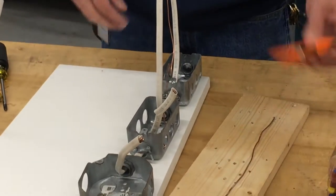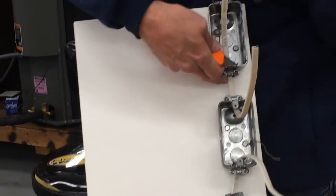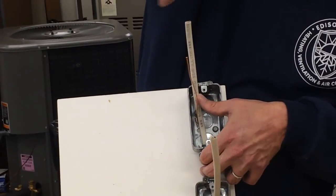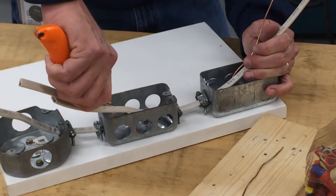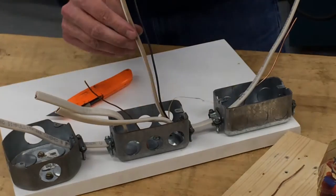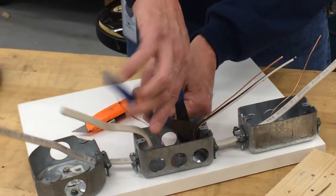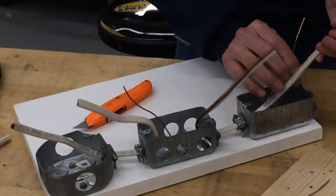We've got everything roughed in, ready to complete the project another day. Take the electrical knife — be very careful. You can't have any white sheathing beyond half an inch of the edge of the connection. Take the blade and try to get in the center of the wire, just lightly running the blade. Always cut away from yourself. Once you get the sheathing removed — make sure you don't cut the wire — you've got two conductors, black and white, and your ground. Pull all the cardboard and sheathing away, and make sure you see three things sticking out before you cut.